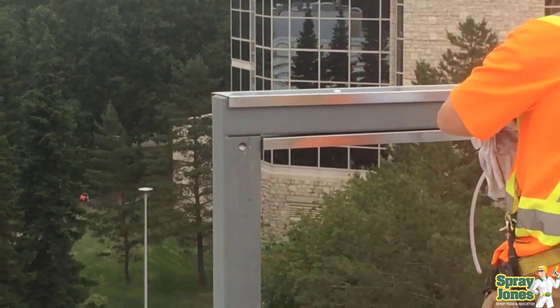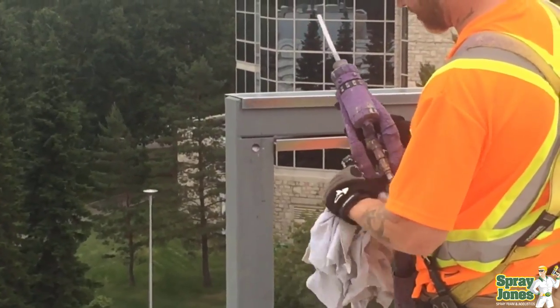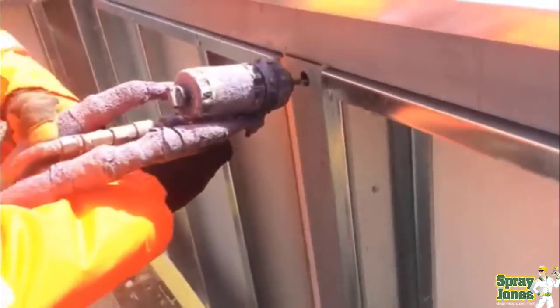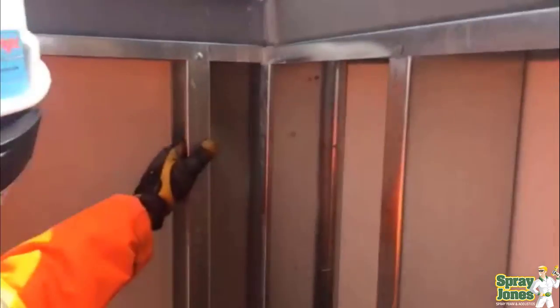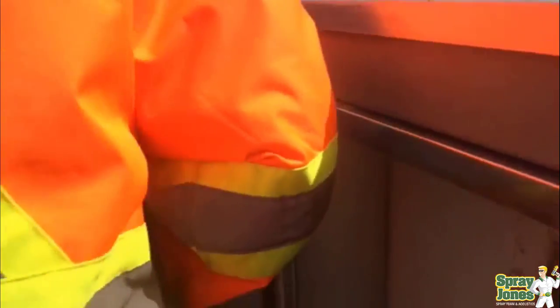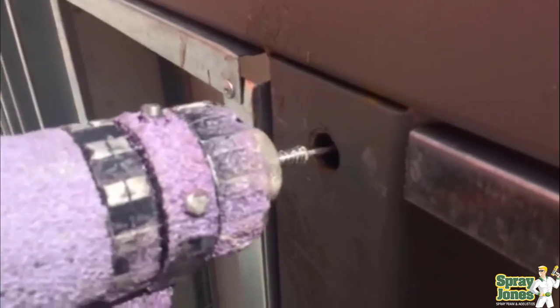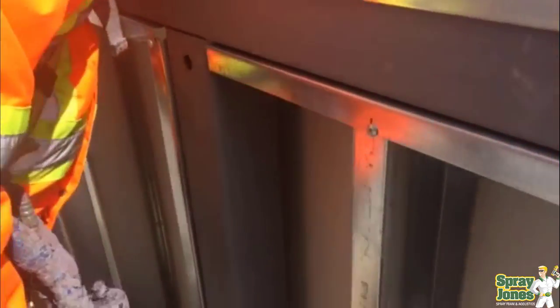You can see he's done a shot, an injection, then a second top-up injection — just setting up his timing to know exactly how long he needs to be pulling the trigger. Once he starts to see the foam coming up and out of the hole, he's good to go. We've ditched the stinger hose for direct injection. We work a pattern because you're not going to do it all at once — we do two or three holes and then come back to the first one. This is a 40-second pour foam so it takes just under a minute to reach full rise. Being in a confined space, once it starts to rise it can pick up quite a bit of speed, so you don't want to overfill it because the pressure inside the tube will cause the foam to come pushing out and rocket out of that hole like a jet stream.